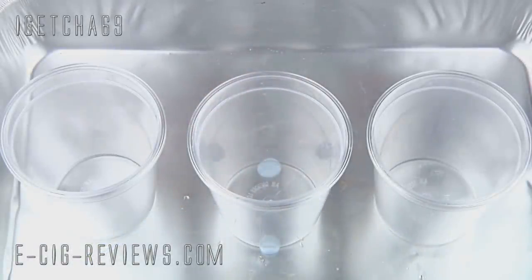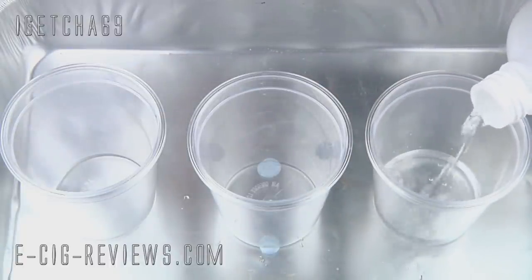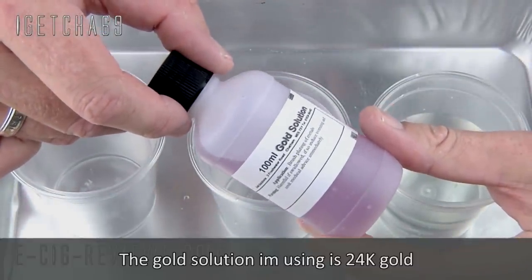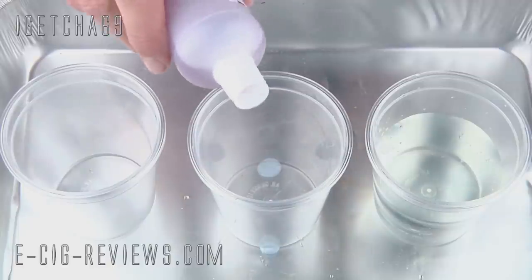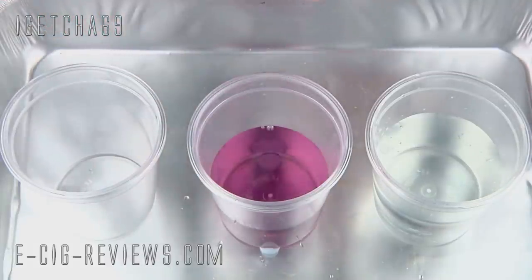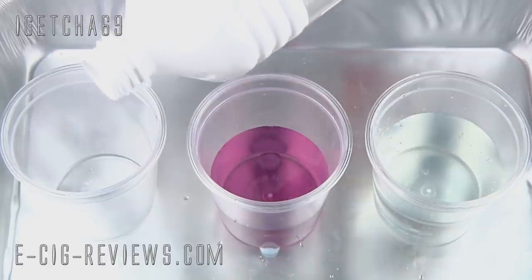I started off by setting out my work area. I've got three empty cups to hold each of the fluids. In the first cup I add some stainless steel activator — if you're working with stainless steel you need to activate it before plating. In the middle cup I add all of the gold solution, and once you've finished plating these solutions just get poured straight back into the bottle so there's no waste. In the last cup I add some deionized water, which is about 99p and available from most petrol garages.